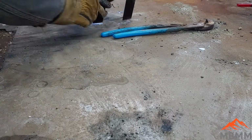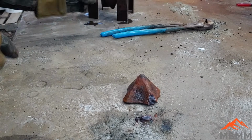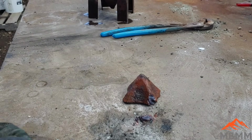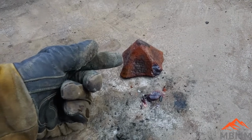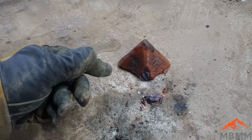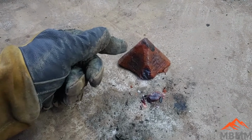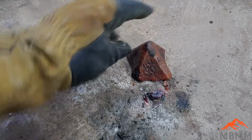All right, guys, well, just judging from the pour, that copper oxide didn't work very well. And somebody tell me why. I don't understand why it didn't work, because the copper oxide should really want to reduce to copper metal, and there was iron and lead and tin in there, and those are lower on the reactivity series. So why didn't the copper oxide turn into copper and oxidize the other metals?